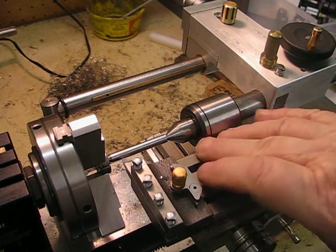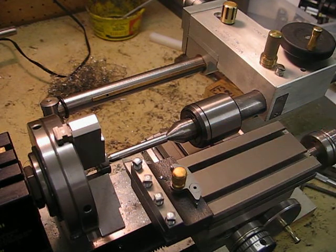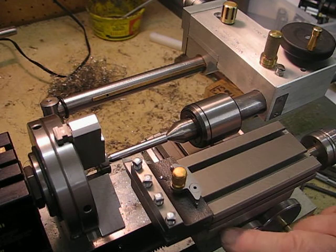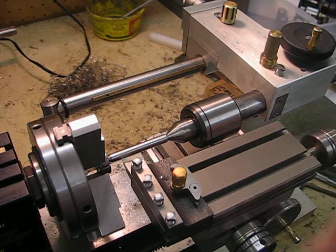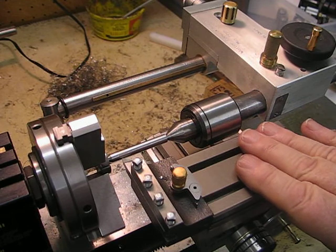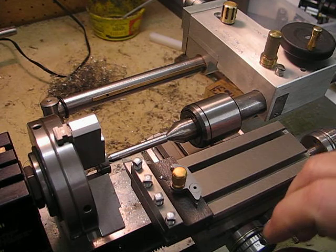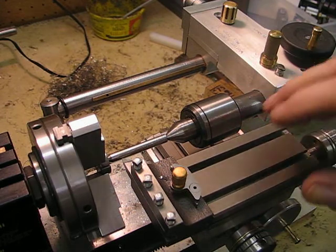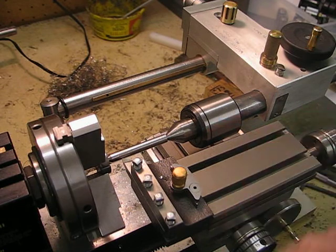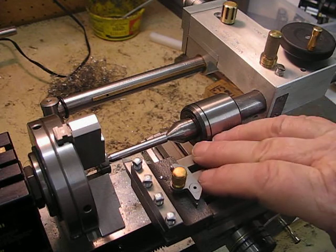I found the tag design was very flimsy and awkward. So I had to make a new base for the top slide because I couldn't incorporate the Hardinge locking system in the original base plate. I made a new base plate a quarter of an inch thicker that allowed me to incorporate the Hardinge locking system.